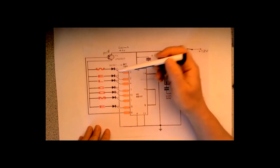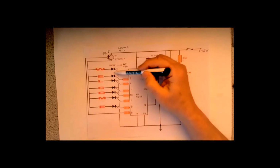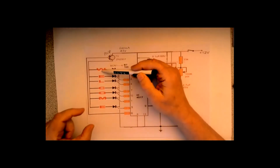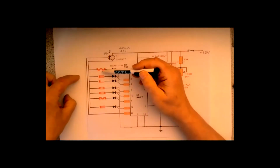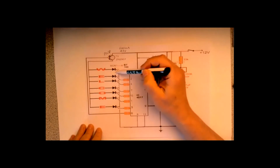The SCRs, generally speaking, handle quite high currents. They're designed for quite high currents. There's no problem in, for example, taking away the set of LEDs we were discussing earlier and putting in chunks of LED strips. As you know, you can cut them into little sets of 3. You could have letters spelled out in groups of 3 instead of using lots of LEDs with their own droppers. It can handle the current.